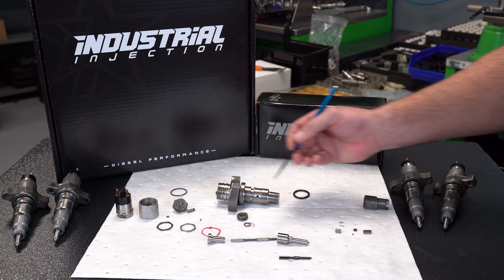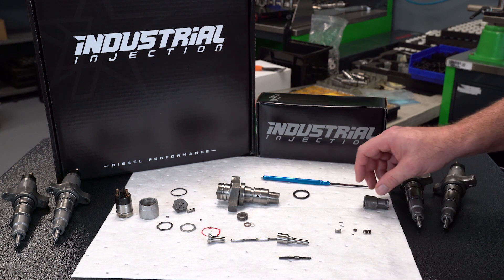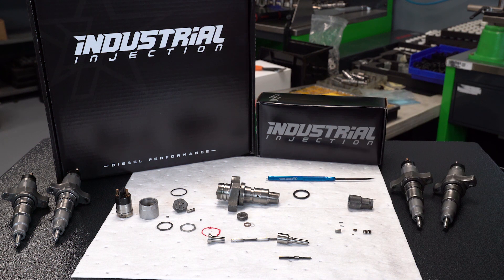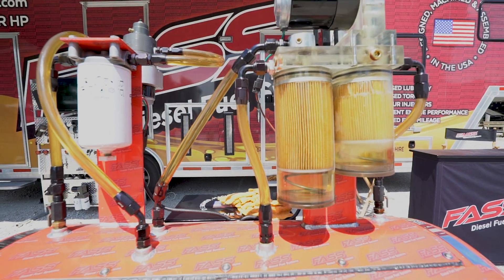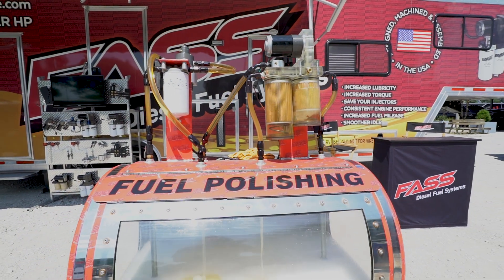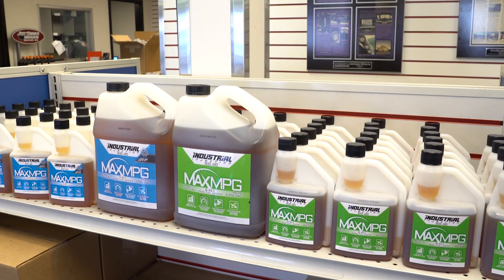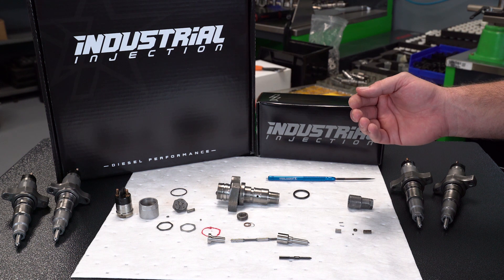This needs to shut off every time and open in time as well. All these moving parts move at a rate as fast as milliseconds as the solenoid opens and closes. Every part has to work in time, so it's important that clean fuel — the right amount of volume, clean volume — is supplied to the injector so it doesn't damage any of these moving parts, and they all move in sequence for an injector to inject properly. We use FASS systems because we believe in them; we've been using them for years. They're the flagship of fuel systems on the market. FASS systems with dual filters separate air and water with fine filtration, and that will help save your systems. We also have our new Max MPG fuel additives — we formulated that because we know the internal components in the injector need it desperately to operate and function properly.